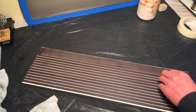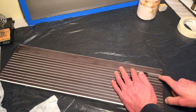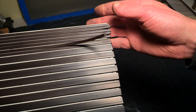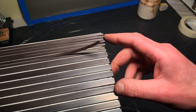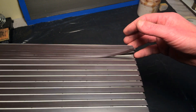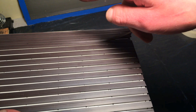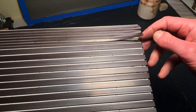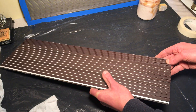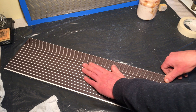All magnets are in — you can see them here on the edges. It's not sitting very nicely here because I broke some of these ridges. I first let the CNC make the pocket, and when I cut the whole thing out, this section is only 1mm wide so it breaks out. That was a dumb mistake I could have avoided, but it's not a huge problem — it will still work.